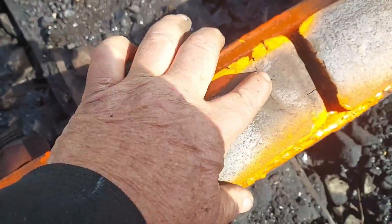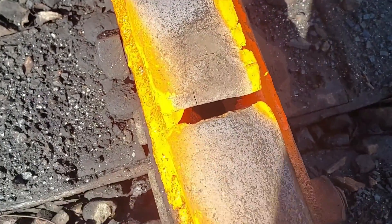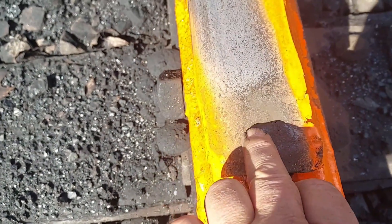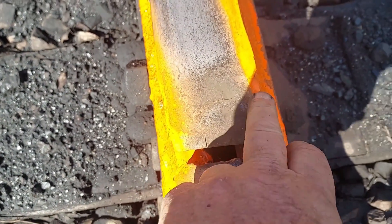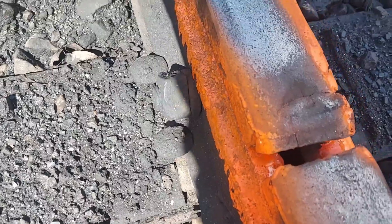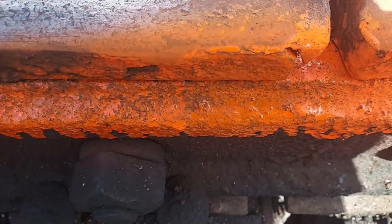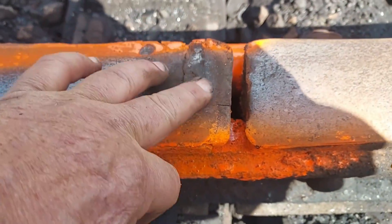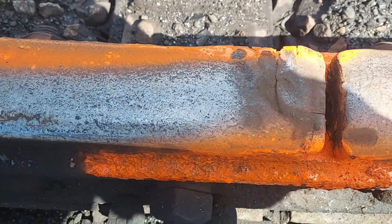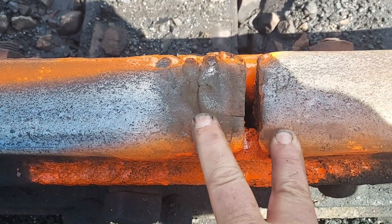It's called a crushed head. I'll try to get this with the sun behind me. See, it's flowing out here. Maybe if you can see that a little better — but right here the rail head's starting to break out. Now, even if this chunk right here did happen to break out and had a gap in there like that on an excepted track, I don't think we would have a problem with it. It looks like it's going to crack out here and this chunk come out if it does happen. But I said this week that rail will get changed. I don't think even if that broke out it would derail — that's not that big of a gap for that locomotive or car wheels to go over.